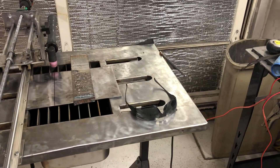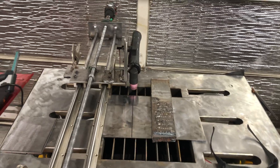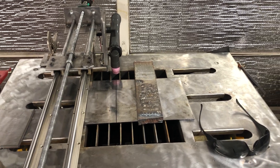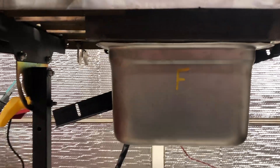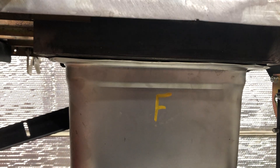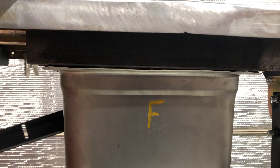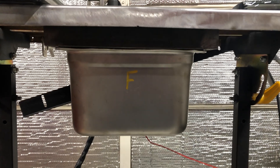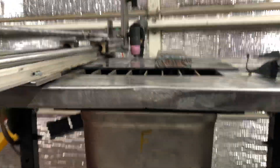Hello YouTube, I wanted to share my motorized plasma cutting track that I made. I'm using it with my Harbor Freight welding table that I converted into a plasma cutter table. It's a one-by-two frame going around a six-inch trough with two inches of water at the bottom. I had a four-inch trough but above 60 PSI the water splashed up, so I changed it to a six-inch deep pan and it worked fine.